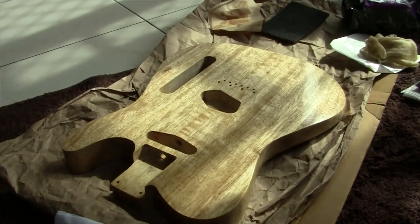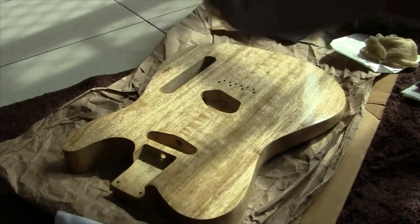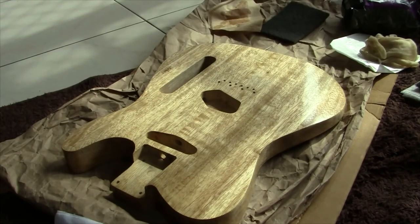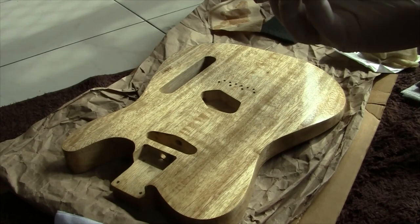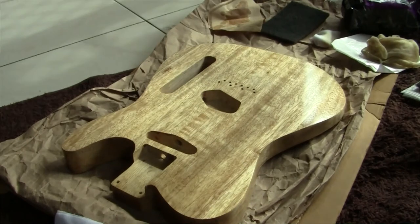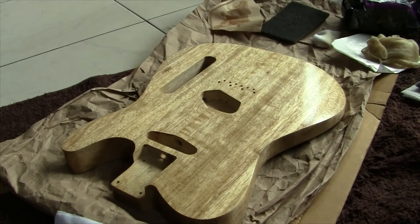Now, be careful of Tru-oil. I have never had it happen, but I have read somewhere that it can light up when it oxidizes itself. So get rid of it, or keep an eye on it for a little while. It's definitely a thing. When I store the Tru-oil for the next coat, I store it upside down, so the part which is air is up there, and it has the skimming effect on top.